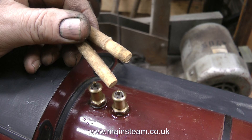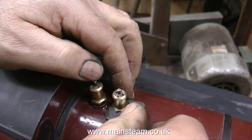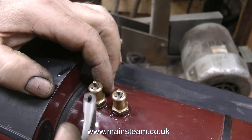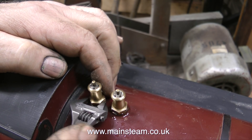Screw the wooden plugs into the boiler with a pair of pliers. The boiler is already full right to the top with water ready for the hydraulic test, and some of this water soaks into the plugs — and as you know, wood expands when it's wet. So very quickly the two wooden plugs become a perfect fit in the holes. Then Simon and myself pumped up the boiler to 160 pounds per square inch using water pressure. Important health and safety note: do not use wooden plugs on steam engine boilers when using steam or compressed air — they're only suitable for hydraulic testing. The boiler passed its hydraulic test with flying colours, with not even a hint of a leak from the wooden plugs.